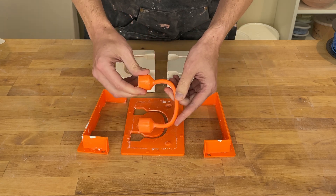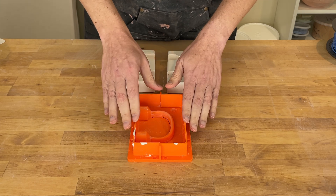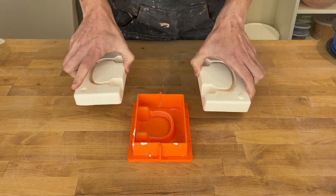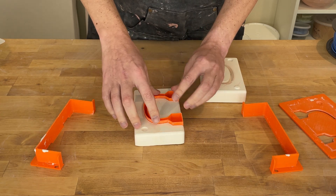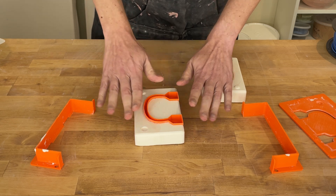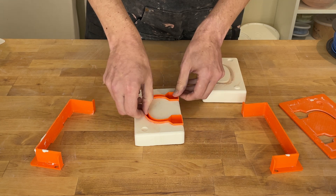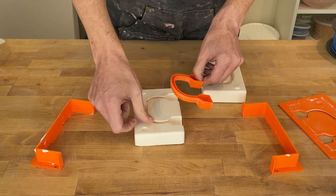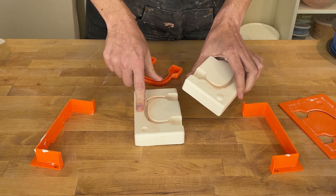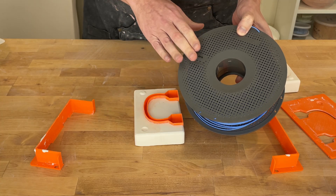There's a bottom plate, an inner part that forms the handle itself, then two outer walls. We assemble that together, pour plaster, and once the plaster is cured, we pull this out. One of the more delicate parts is actually removing this piece out of the mold — when we pour the plaster, it winds up embedded in the plaster just like that. The walls are intentionally very thin so they flex a little bit. However, the plaster itself is rather delicate. This edge here is a right angle, and plaster doesn't really like these sharp corners. That corner is really needed because we have a two-part mold and we need to put the mating faces together. Pulling it out requires some patience, and while ceramics is great at teaching patience, it still isn't my strongest suit.